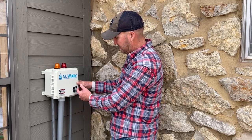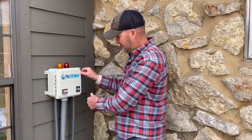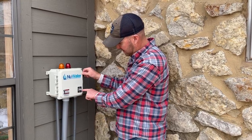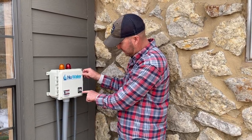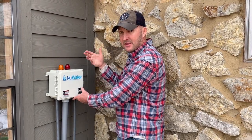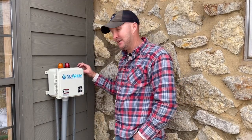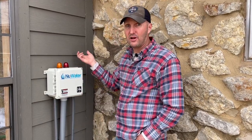You can test your alarm on the outside with the compressor test button — it says COMP, which stands for compressor. If it's making a loud beep and telling you something's wrong, you can come out and push that switch from run to mute. There are three settings: run, mute, and test. I'm testing it right now, which is what's making that noise.